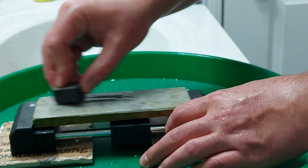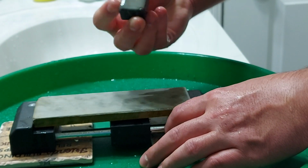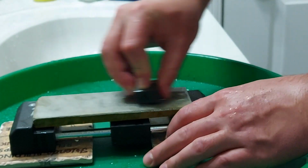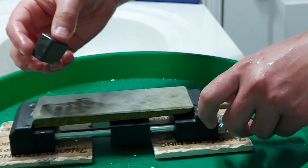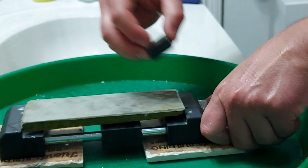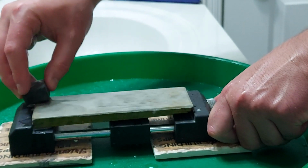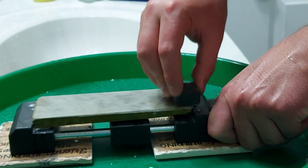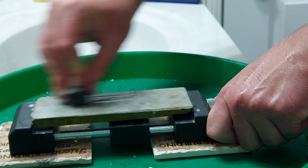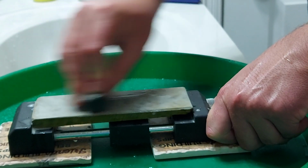When you're making slurry, make sure that you also catch your edges, just to make sure. Every time I make slurry on this stone or my Ozuku, I always make sure that I'm running the tomo across the entire stone. I want to make sure that there's nothing funky going on. And then I also run it on the edges just to make sure that there's nothing there. And if there is, this tomo will knock that off. All right. Everything seemed okay, so now it's just time to make some slurry.